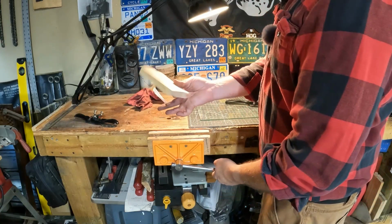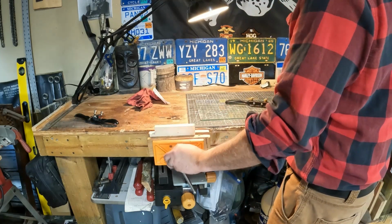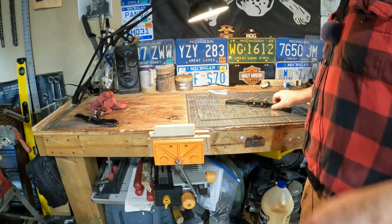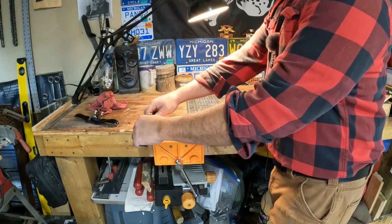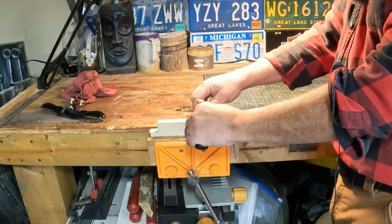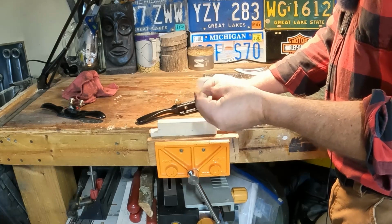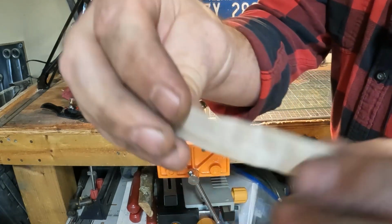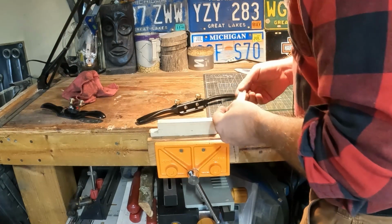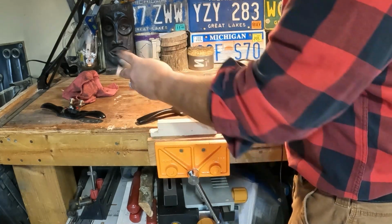Okay, so I've got just a piece of 3/4 inch thick pine, softwood. It's got a little knot on the end. We'll see how that works. And let's see how well it cuts. So we've got our plane, or I keep calling it plane, a Spokeshave. Look at that. I'm barely pulling, even though it looks like I am. But that is just whisper thin shaving. That's really nice. That's cutting really, really well. That cut through quite nicely, actually.